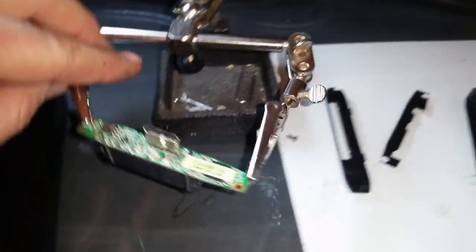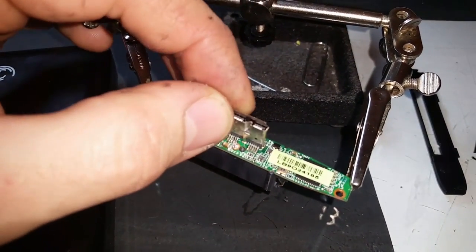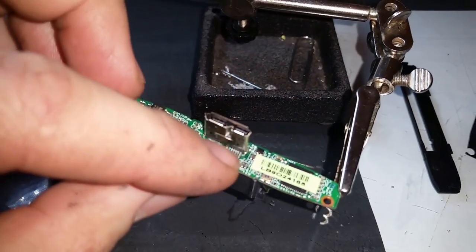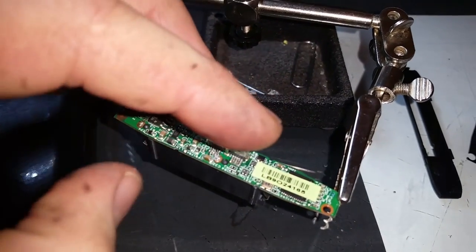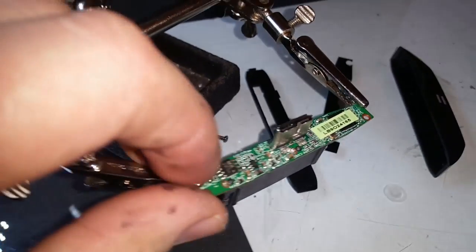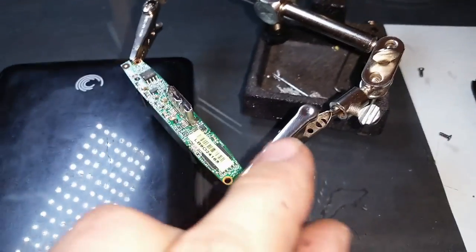Here is the adapter removed from its housing. This is where the USB cable plugs in and I can wiggle it back and forth — that's a problem. Using a magnifying glass, I was able to see that the little electrical connections were broken off and only sometimes making contact. There are solder connections on the back side that attach to the sides and middle of the metal USB jack that are supposed to stabilize the jack, and those were loose too.